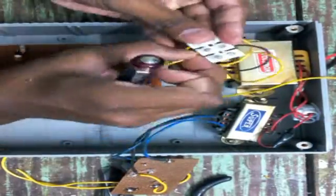Similarly, by marking and making holes, I fitted the two transformers using nuts and bolts, and made connections to the PCB using terminal blocks. I made all proper connections using terminal blocks and used double-sided tape to stick them to the enclosure, as you can see in this video.